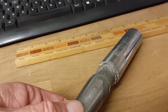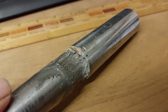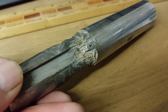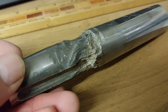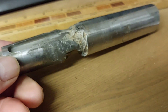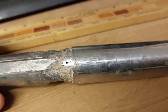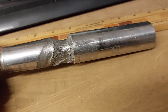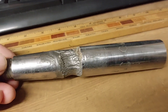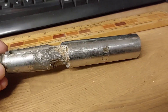Anyway, they took the propeller off and I think we were all gobsmacked to see what we found — probably one of the best examples of crevice corrosion I've ever had, where the starvation of oxygen from water being trapped under the taper had occurred. Bear in mind this is duplex stainless steel and the shaft was only five years old. So just think about how important it is, when you have stainless steel underwater, to make sure it gets oxygen.